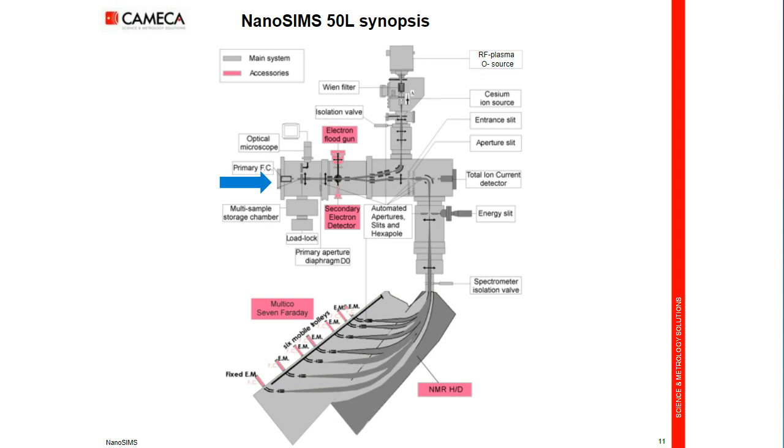The vacuum in the analysis chamber is extremely good, with ion pump and titanium sublimator pump reaching down to the 10⁻¹¹ millibar vacuum range. Then it's time to visualize the sample with an optical microscope — a few millimeters above the sample at the analysis position — visualizing a 700 by 700 micron field of view, so you can travel and choose your analytical position.